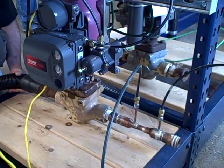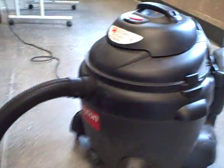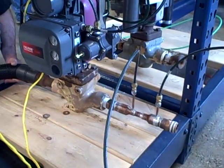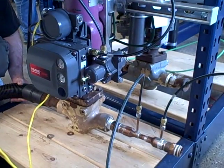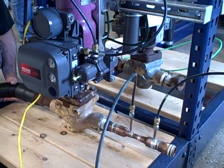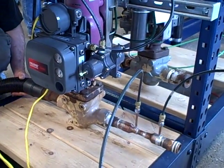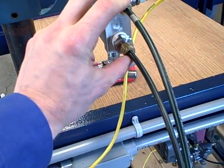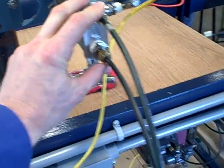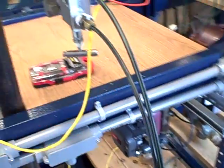It's nothing like throwing $15,000 worth of control equipment on a homemade airflow vacuum cleaner process, just because we can. Anyway, the point of this is to build a PID control loop to demonstrate PID control and control action, and then later we're going to add a safety shutdown system to this loop where we monitor differential pressure using a pressure switch. If that pressure goes above a certain limit, we will tell the vacuum cleaner to shut off, pretending that's a dangerous high flow condition.